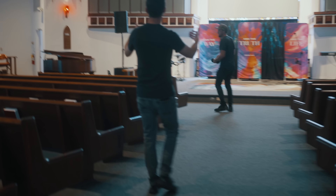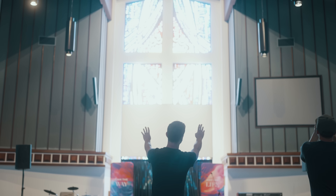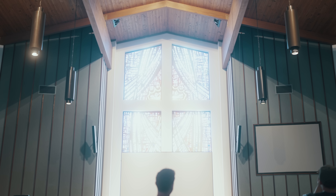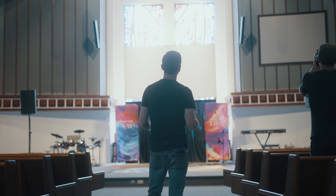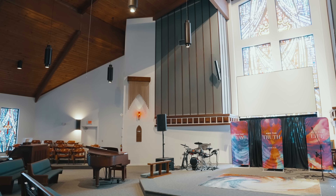To replace all of this would be way too costly at this phase, so let's work with what's here but integrate new equipment so they can have DMX control of their house lights and an easier way to maintain and manage that system. Coming into the room, I see two chandeliers up there — those would go away. The two fixtures right over the stage can be removed too; it's going to open the area up, allow for the kick light to shine through, and get out of the way for the screen.